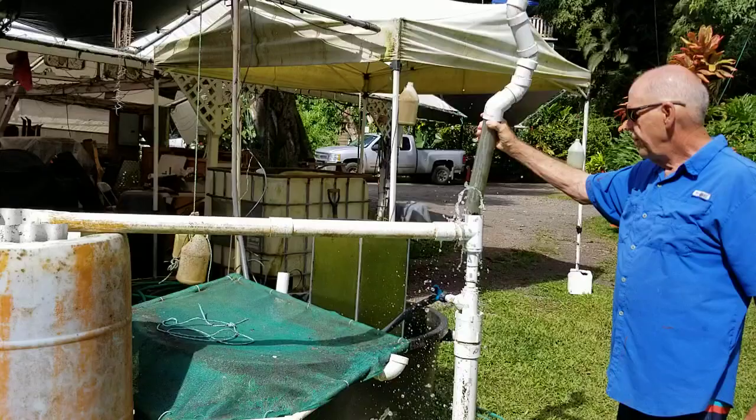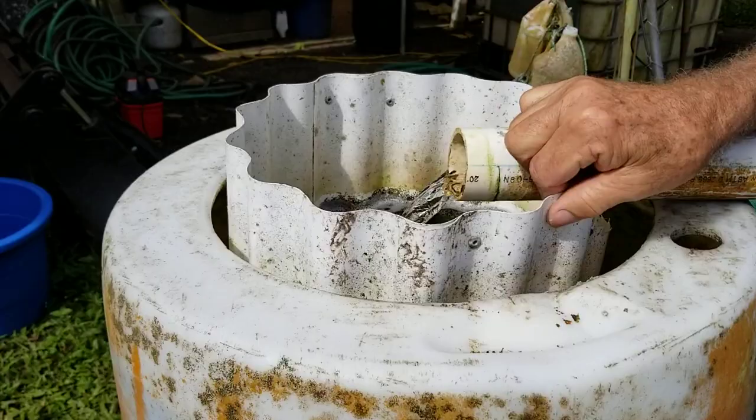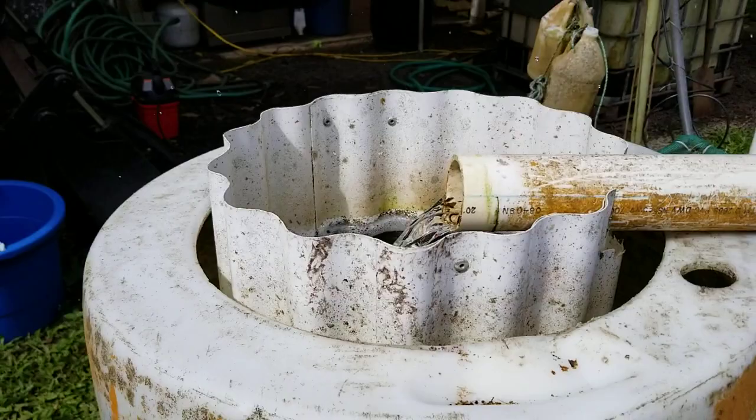This collects it. The air comes out here. The water heads over here and you see the water coming into here. When it comes in here it falls and it's going to go straight down — this goes within four inches of the bottom. There are little legs on this. So the water is going to come in here, go make a U-turn and it's going to decant.